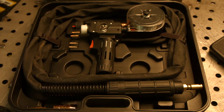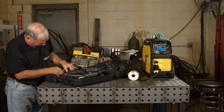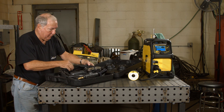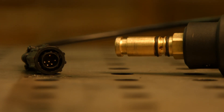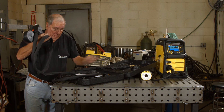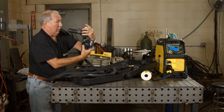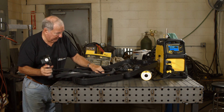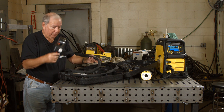Let's see what we get in here. Everything is even latched down with little Velcro straps — that's pretty slick so you don't go sliding all around. Right away you can tell this is going to plug in where the MIG gun used to plug in and connect for control the same way the MIG gun controlled. Unlike the wire feeder machine where you're feeding wire all the way down the whole length of the gun to the torch, with the spool gun the aluminum feeds right here through the drive rolls and into the nozzle and torch for the arc. It's a very short distance, and that's the whole key to welding with aluminum — keeping that distance as short as possible.